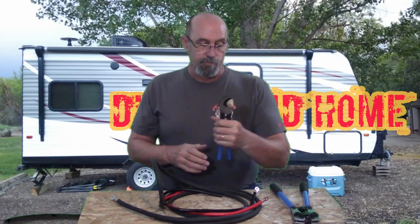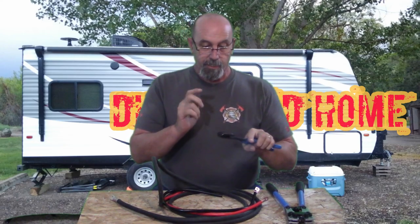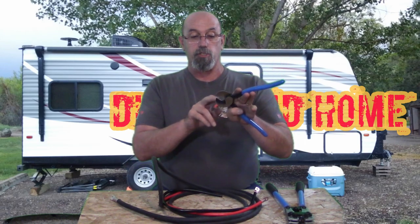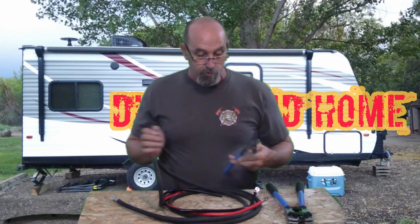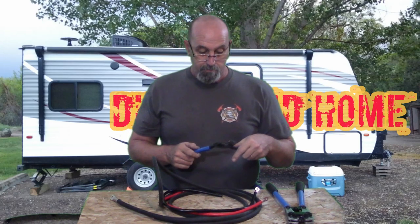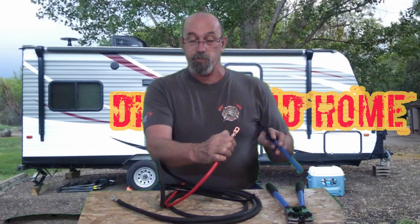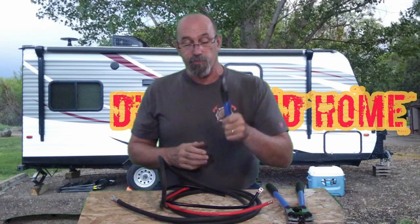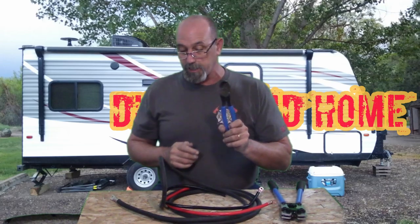As far as the cutters, I would not buy this kit just because of these cutters. The cutting edge is too hard and I've already seen some chipping in the cutter edge after only about 20 uses — most of it just trimming the sheath back to put the lugs on. So I would not buy it just for the cutters. If you do plan on doing a bit of work and you get these, plan on getting a different set of wire cutters.